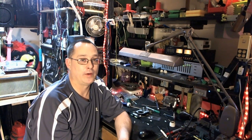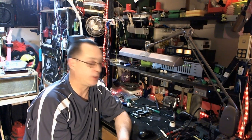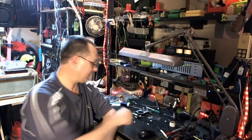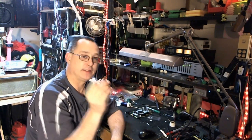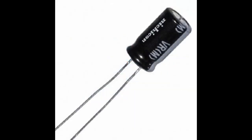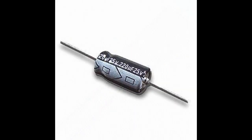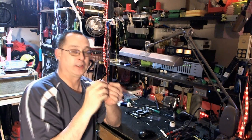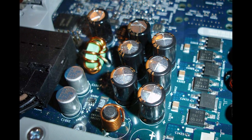If you have a device that's not under warranty but you've only had it for a little while, you can open it up and take a look. If you inspect the capacitors — they look like a little battery, basically — they come in all different styles. If you look at the top of them, they're supposed to be flat. If the top is bulged or separated and opened up, you've got a bad cap.